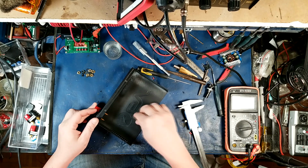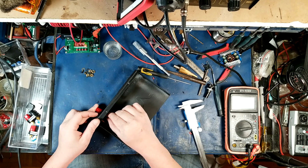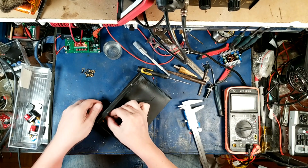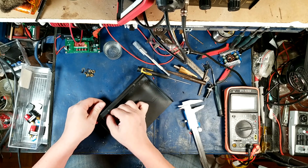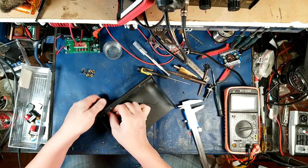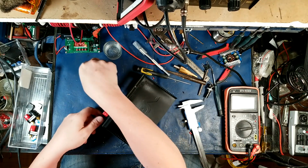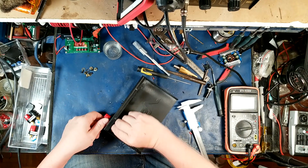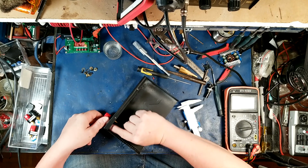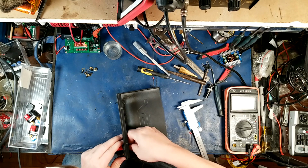Alright, and we'll toss on the burr washers. And now we can get the preliminary tightening in place. Now, when we really crank these on, we want to make sure that the divots are sitting in their place. Because it'll actually pull itself into them and lock it in place so that there's no way that the brass can offset and potentially cause a battery short.